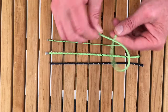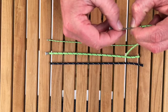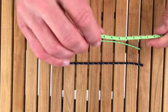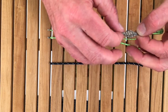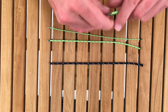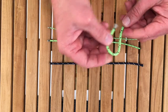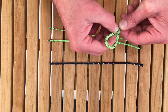This is the 1/8 inch. Now we've moved into a braided core — let me show you that — a braided and coated core. And if you want to get really nuts with a halyard on a dinghy and strip that, it's a nice braid angle on the Vectran. If you strip it, you would do a 12-strand eye splice in the end. If you didn't strip it and you wanted an eye, you would probably do a core-to-core splice, but you wouldn't be able to bury the jacket back down in here — you'd have to terminate it right here.